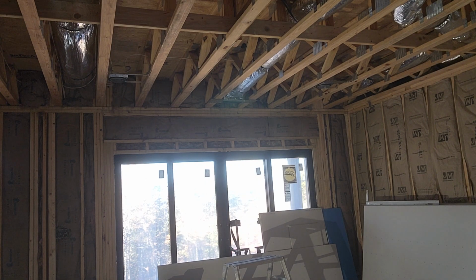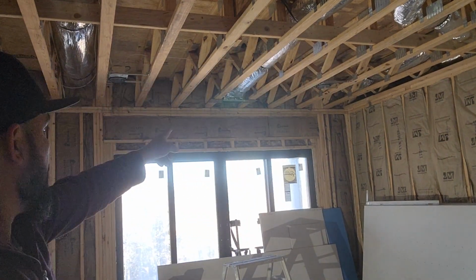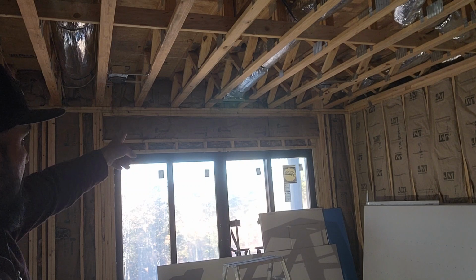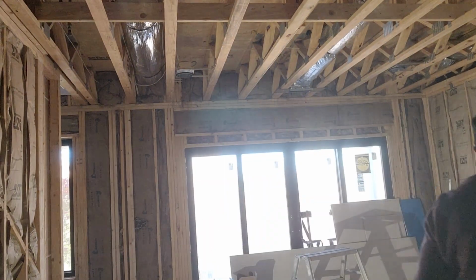Okay. If we start with that, then we're gonna have a joint in here pretty close. Now I don't have any more options because I have the air vent on my way, and then I have the can lights. If I cut it 1 foot that way, it's gonna be too close to the air vent, and then my joint on this corner, right here, is not gonna be okay. So let's start with a 48. The 4 footer. Okay.